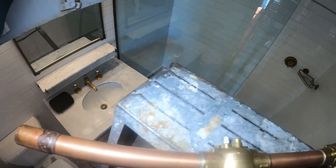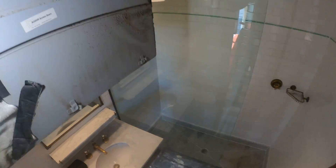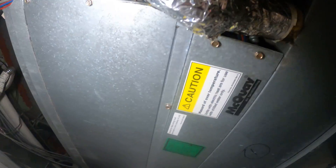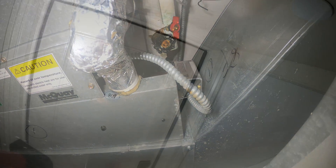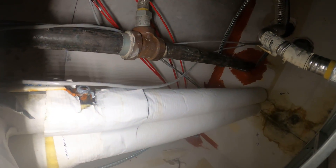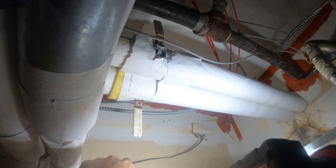These are soldered connections, super clean, but for the edges I prefer brazing, so I have one side with a coupling brazed and on this side I have a slip coupling. The idea is to cut over here and install this there, then run some wires and have our actuator over there where we have space. Here's the room we're working in — we have an access panel and right there we have a shutoff valve for the room. These two valves, the supply and return, are now both closed.